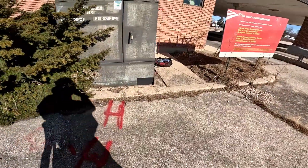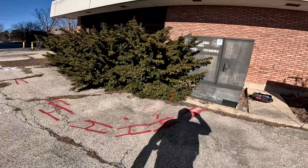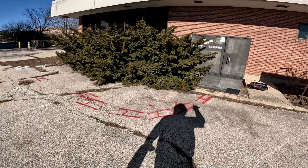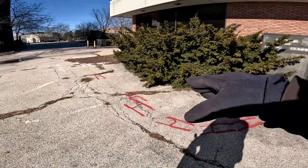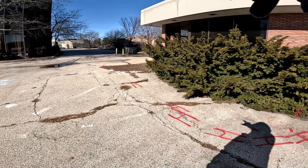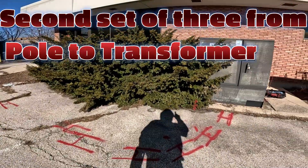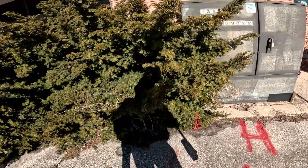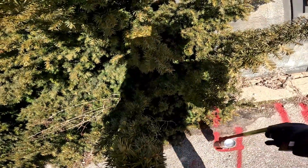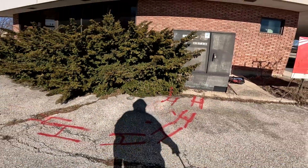Off this transformer, we have another cable coming off the pole. So we have to go to the pole, hook up, and get the second set out here. This is the first set I marked out that goes to that transformer — a set of three. Then we have another set from this transformer going all the way to the pole. So there are going to be two marks here to indicate six cables, and there will be another mark here from the pole.